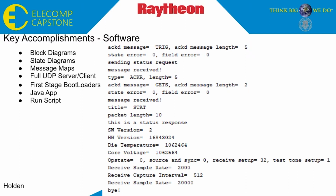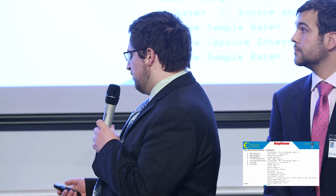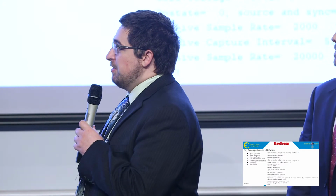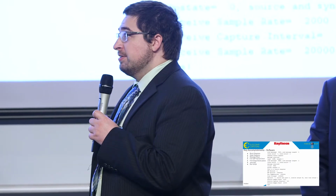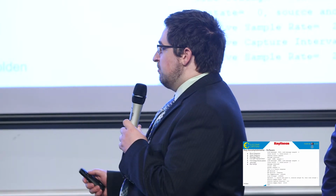During my tenure on the software side of this project, I was tasked with first creating, of course, the paper design and then actually implementing it in both Java and C. This included, for example, the UDP server on the embedded system board, the UDP client on the PC, the Java application on the PC that ran the client, and the script within the Java application that would take all the parameters supplied by the user and send them down to the hardware.